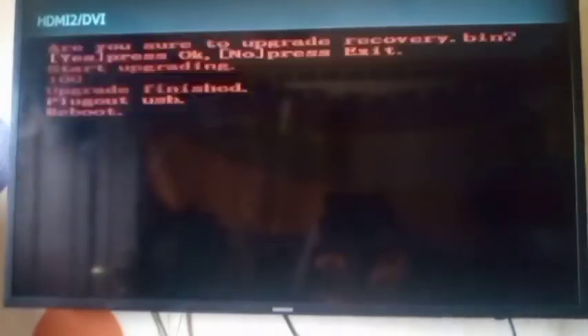I've turned it off and inserted my USB flash drive at the back of the decoder. My software is already renamed 'recovery.bin'. Now I'm putting power in — turning it on — let's see what will happen. You see — boot! Look at it!